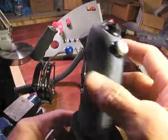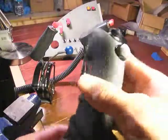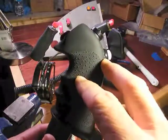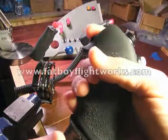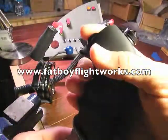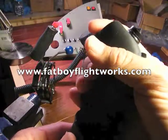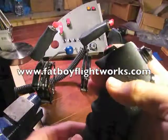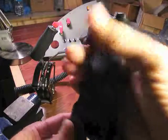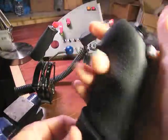For this particular design, I have enough space in the head to get up to three stations of switches. In this case I've gone military spec for the push buttons with tactile feedback. This is wired for push-to-talk — you're going to hear it and feel it, which I like. Either way, you just press to the bottom if you don't get the tactile feedback, but that feel was an add-on feature I wanted.